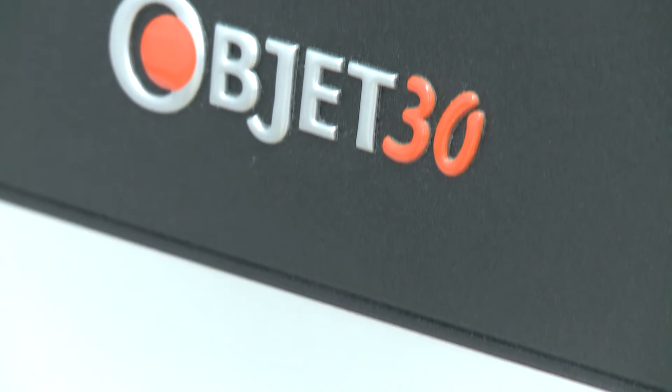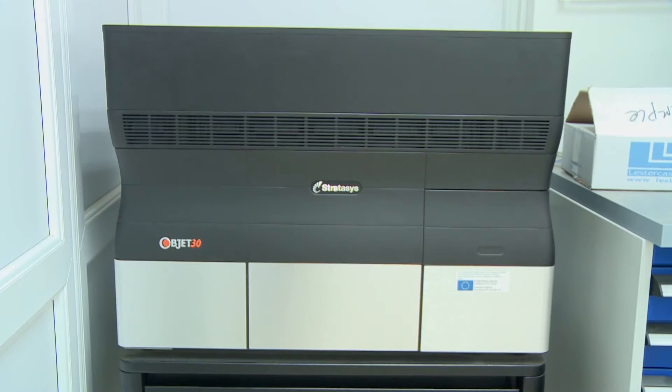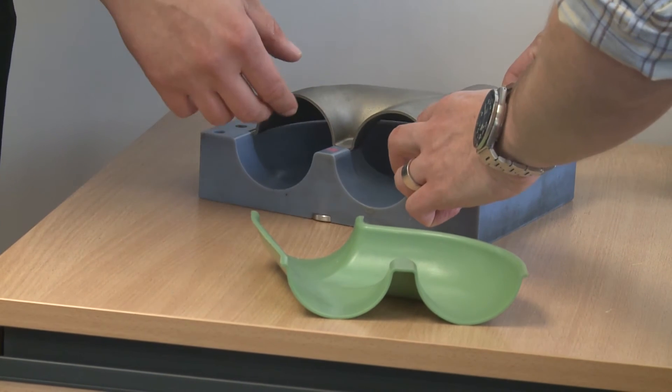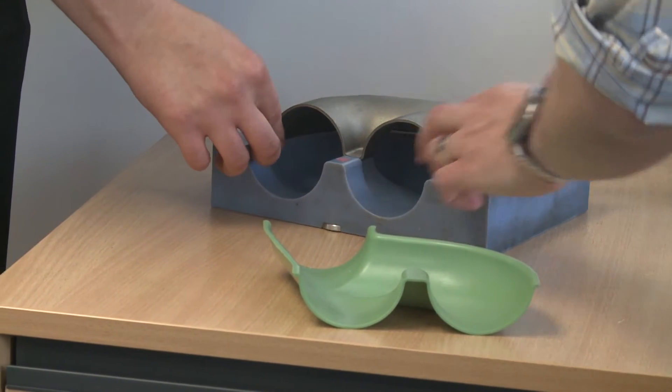The third way is an in-house technology that we're developing. It is a plastic tooling — we're printing natural tooling on a 3D printer, putting the two halves together, and injecting wax into actual plastic tooling. This gives us control at LeicesterCast to produce our own parts. We've got planning permission for a new building at the back of LeicesterCast.